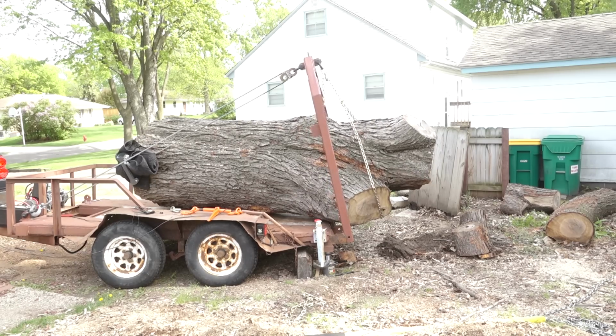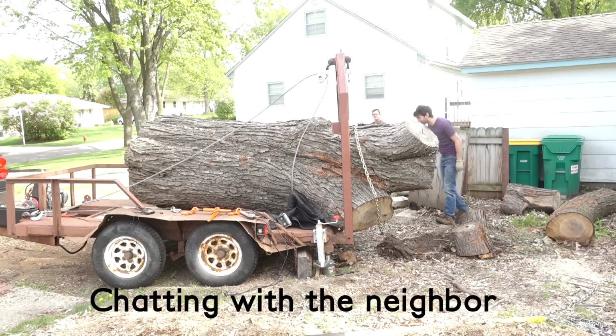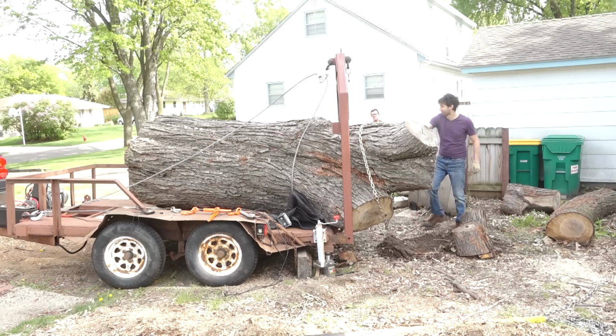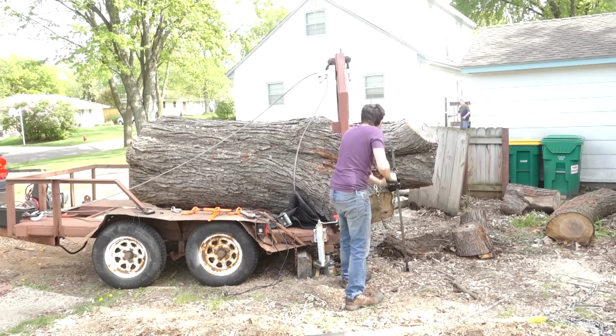The advantage there is that the cable doesn't have as much stored energy, so there's less risk of severe injury if it does break. The downside to those is they don't have as much wear resistance, and in an application like this, the cable does take a decent amount of wear.